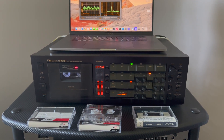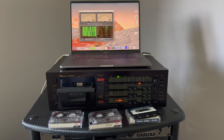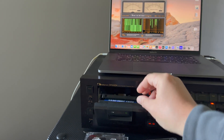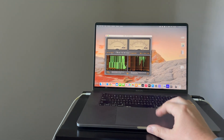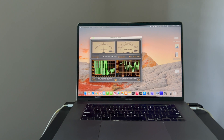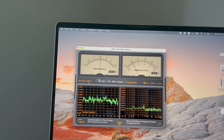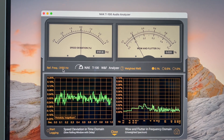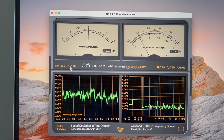What a nice deck! Now for the final part — let's test the tapes which I recorded. I'm installing the reference tape at 3150 Hz and checking wow and flutter while it's playing. The reading is 0.02122, with an average of 0.02.